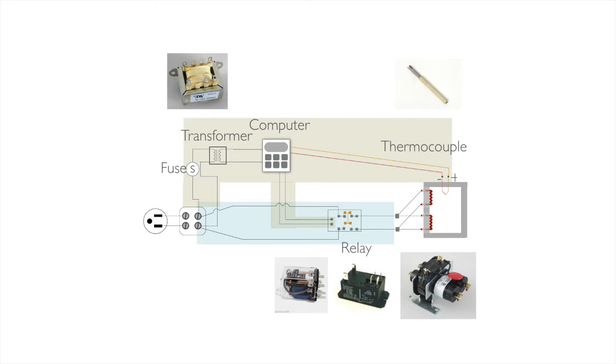The same way, if I've got a computer that opens up, hi, I'm here, ready to go, and it's telling the relays to turn on and off, but they're not, well, how do I see that? Well, I may have one section that's out, but the other two are firing fine. What can cause that? Well, the relay that's driving that section could be our problem. It could be the computer, or it could be the elements in that section, but it's not gonna be the transformer, it's not gonna be the fuse, it's not gonna be the parts of the system that aren't in line with that. And so we can use our diagrams once we understand them to start diagnosing things, follow the maps, and see where they go.